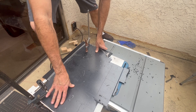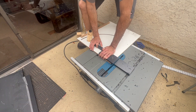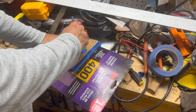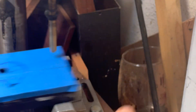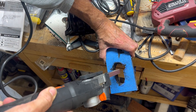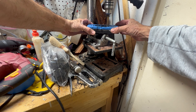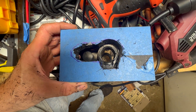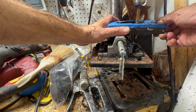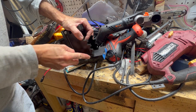Making the steering assembly, I started with a cardboard template. I made sure the template fit snugly over the original steering assembly that came with the motor. Once I had two pieces of matching marine board, I glued them together and clamped them overnight. I put blue tape on them and traced the template onto the blue tape. I then drilled holes and cut them out with a jigsaw, carefully opening up the holes with a trim sander. Remember, you don't want this opening to be sloppy — it needs to be a pressed fit. Be careful not to open up the hole too large; it should take some force to get over the original steering assembly. So take your time, don't take too much off, and be patient.